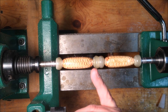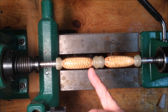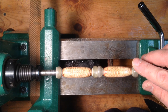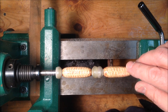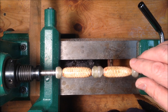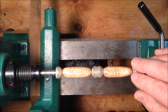The blank is looking really good. I'm applying CA from opposite directions because it tapers off and it's a little tricky getting down beside the bushings. I applied six coats of CA glue to both blanks and sanded with micro mesh, then came back and applied three more coats. It looked really good, so I grabbed my one-step polish and polished up the front and back blank. I'm extremely happy with how they've turned out. I'm going to get them off the lathe and press them into a pen kit.